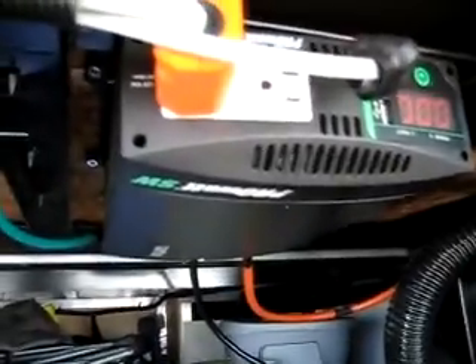The heart of the solar system to get 120 volts is the Xantrex Pro 1000, which gives a pure sine wave. These are the two AGM batteries — Lifeline 6 volt — kind of jammed in there. I modified this cover; it was the old single cover and I made it a double so it'll vent out. There's a little controversy on whether or not you should vent it, but I've decided to be safe and do it.